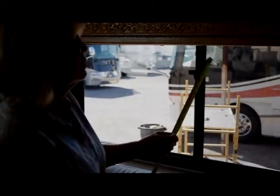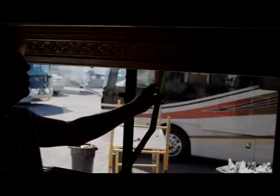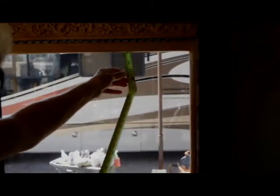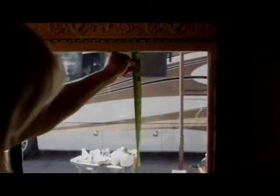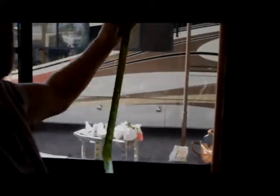For your height measurement, you're going to put your tape measure up inside to the top. Sometimes you have to go off to the sides. Put your tape measure, go all the way to the top, then go down to the bottom of the window frame — this one measures 28 inches, and that's the measurement you give.